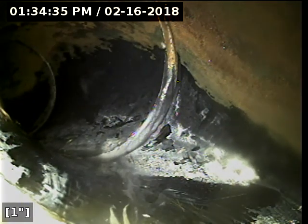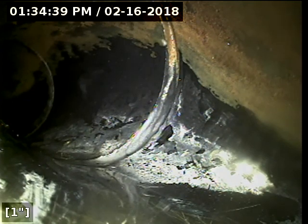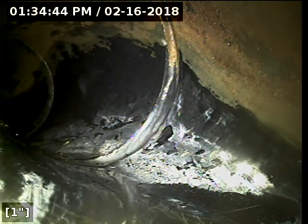Their food down the disposal, that stuff's going to get through there without any issue whatsoever. It's your paper towels and cooking grease, tampons, diapers, crazy stuff like that that are going to hang up. And those items will hang up in a perfectly draining line anyway. So anyway, we do have good flow all the way out to the main lateral. Within the footprint of the Unit 103 has perfect flow and is all in good condition. The sewer line is functioning at this time.